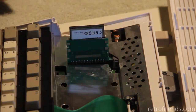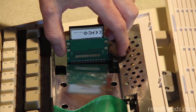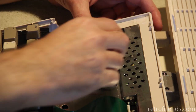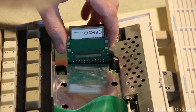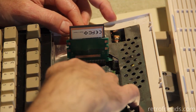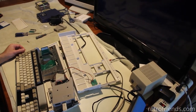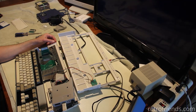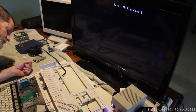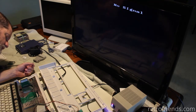The EMI shield isn't shorted anywhere — that's my only concern. The RF modulator is kind of sticking out and in the way, but it's circuit board against circuit board edge so I think I'm okay. There might be a delay on the boot before it went to floppy, and I guess that's because it didn't see a hard drive. We've got a red light over here, but unfortunately it's solid red, so it's not going to work.